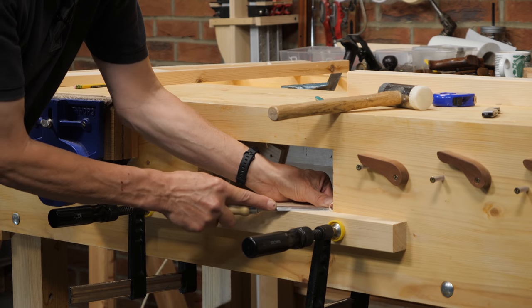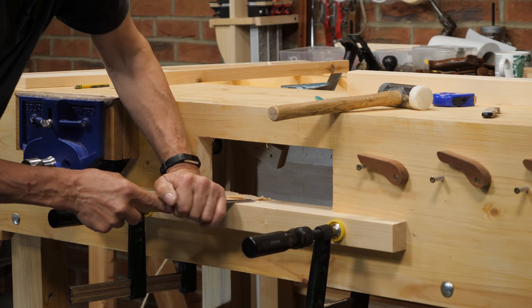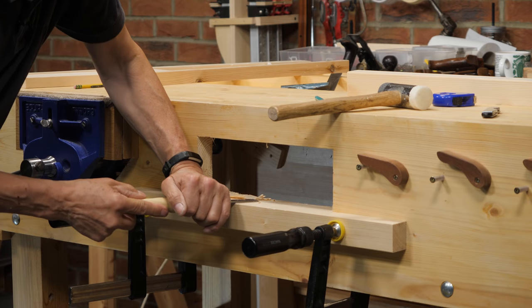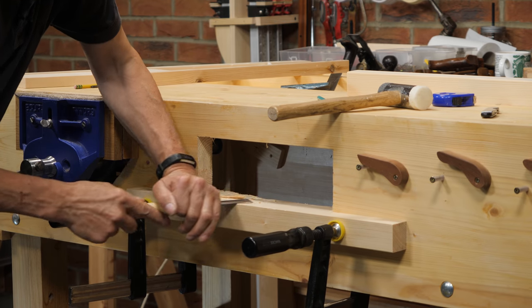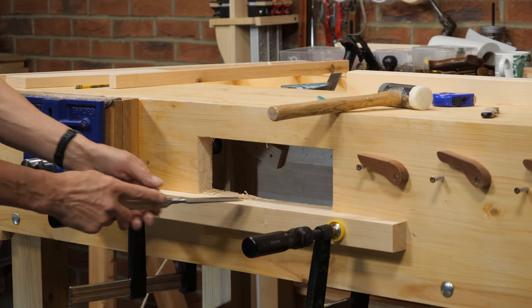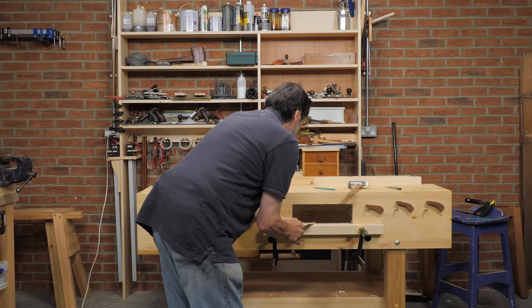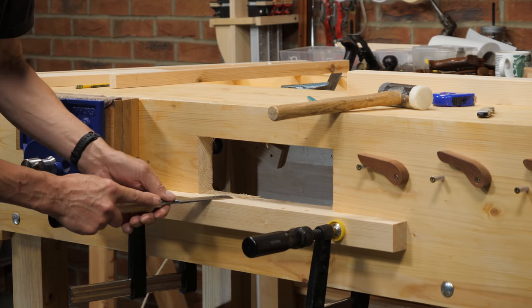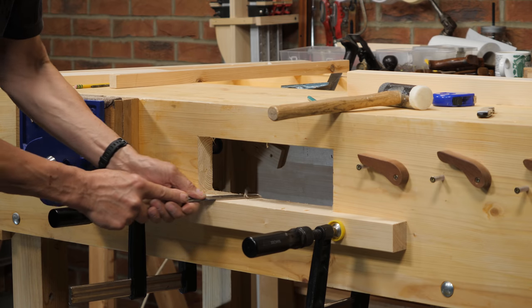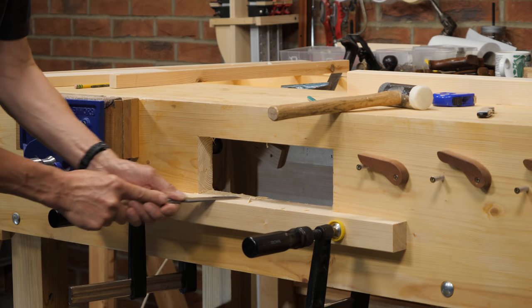rim here so the drawer will sit at this level. This is the final level. I've got a big old knot right in the middle here. Not always easy to pare cut. If the knot works, then the surrounding grain usually doesn't. If you do hit a knot, surrounding grain causes you a problem. If the wood is too thick here, just raise your chisel a little and use it as if you were planing, going down gradually.